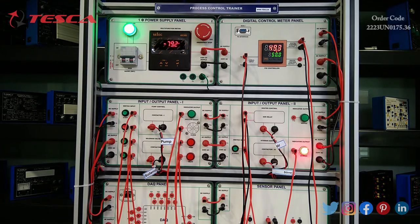The whole process with the RTD sensor works on 4 to 20 mA input. According to the PID controller, we note down the reading of the actual temperature with respect to time and plot a graph. The stirrer works for mixing hot and cold water to keep the water temperature even in the measuring tank. When the measured temperature is less than the set temperature, the heater will heat the water, and after reaching close to the set temperature it will stop and try to maintain it.